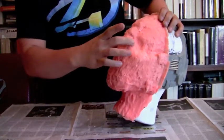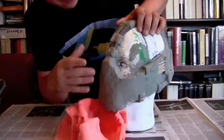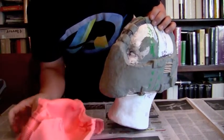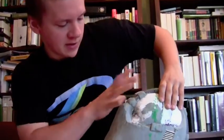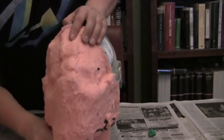If you have cave-ins on the front — like where the nose area goes inwards — and your Rebound is brushed on too lightly so you can still see all that stuff, then when you pour the plaster in and it's solid, there's just no way to pull it out. You're going to have to crack it. I had to make my mother mold three times because the first two times I didn't understand — it cracked the first time into seven pieces, second time again. Then it hit me that I had all these cave-ins, so I put on more Rebound and got that fifth layer in.